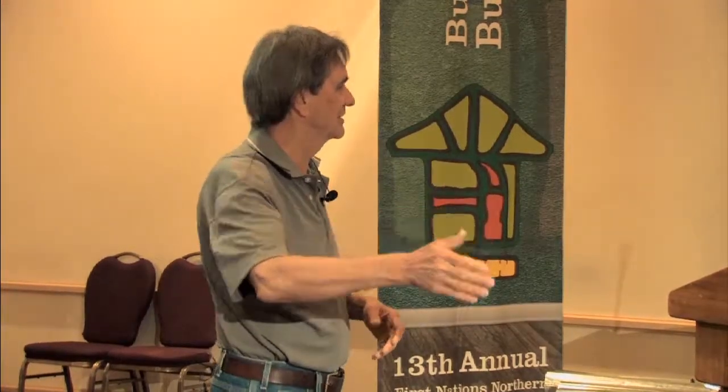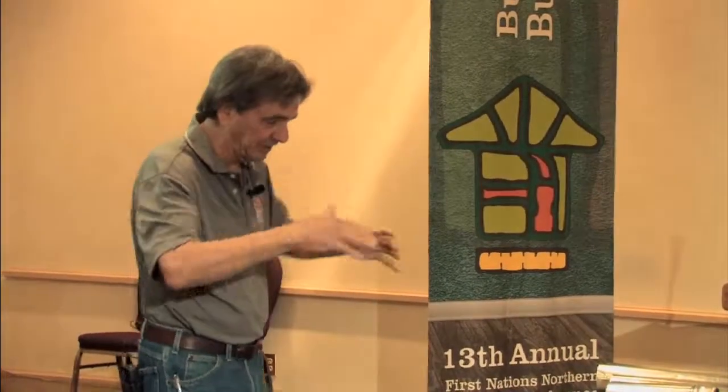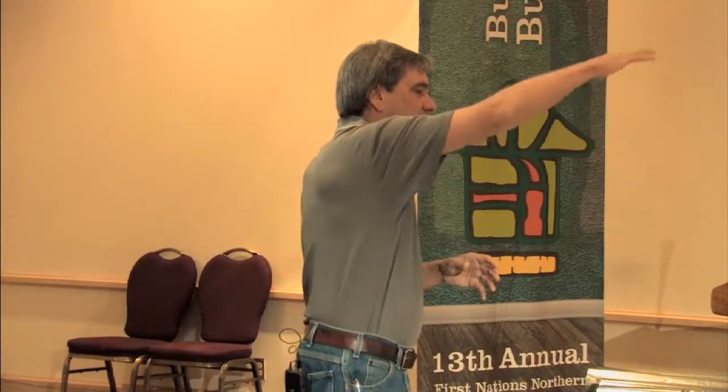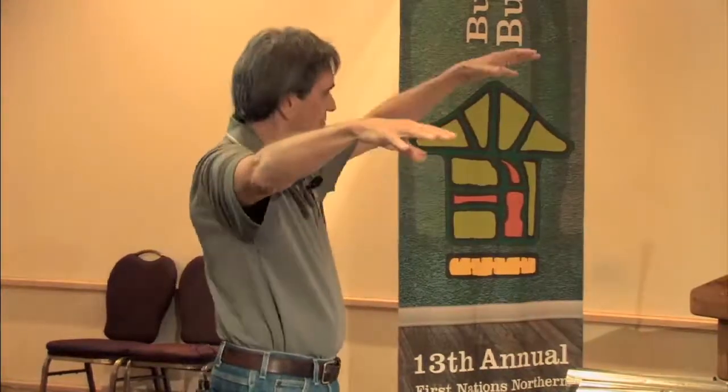Okay, because it's going to fill up, the room's going to pressurize, and it stops there. And so you either have to open the door or cut the bottom of the door off. In rental housing, I cut the bottom of the door off. If you can build it with a cold air return for the master bedroom, fine. Then you don't have to worry about that.